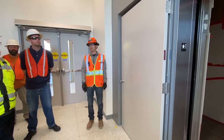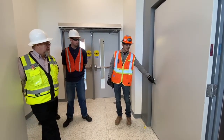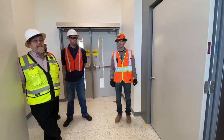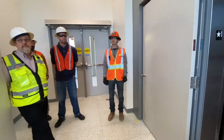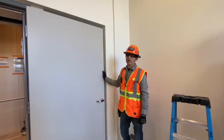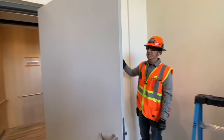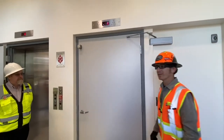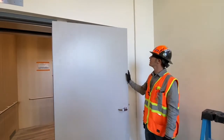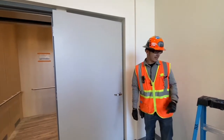Pretty basic, nothing that special like the ones upstairs. Obviously they can be opened from the inside — yes, you can open them from the inside. It's just a passage latch, so you can get in or out, but in the event of a fire, they have to be sealed. Any questions about these? All right, let's go to Building B. Same scenario — all the metal doors on the first floor and third floor, same thing, connected to the fire alarm. In the event of a fire, the mag releases and lets you know that they're shut. Let's take it up to the second floor.